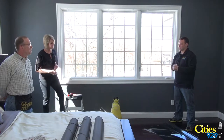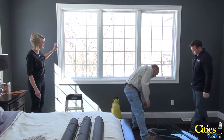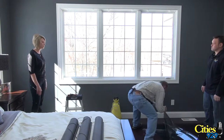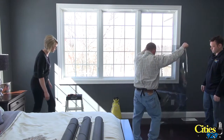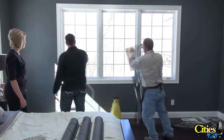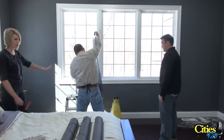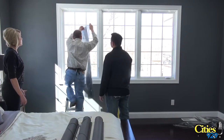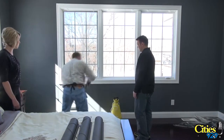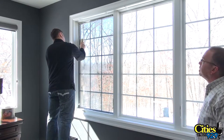Jerry, show me how to do it. So Jerry has already cleaned the windows — we just use a soap water solution. He's going to scrape the glass with a razor blade. He does it very quickly. Now he's just going to apply the film right to the glass. Start from the top, work your way down. Overlap your squeegee strokes, kind of like when you're painting.